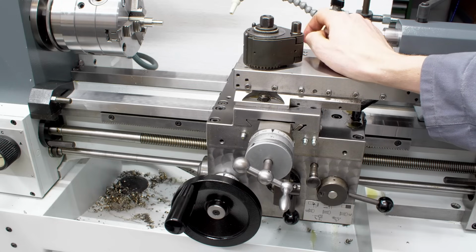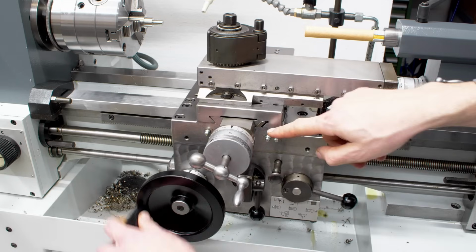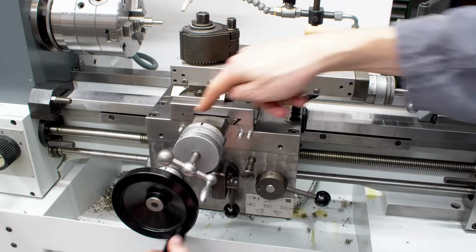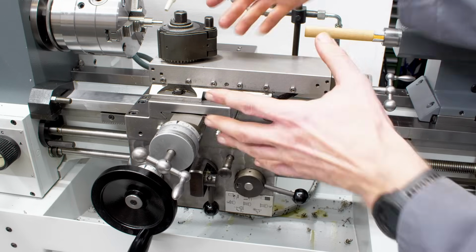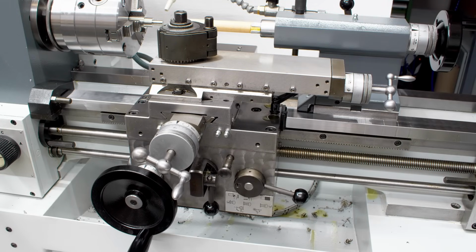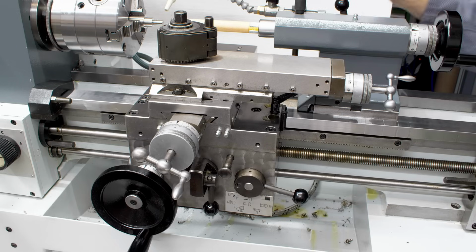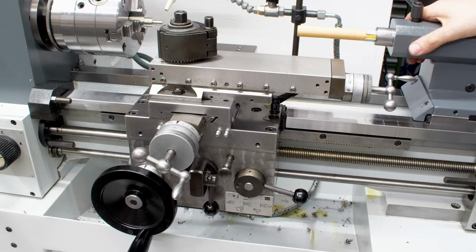This machine is built for 12mm tooling. So that's the carriage, and you see all the fittings here, the Zerk fittings. These are for lubricating all the moving elements. We have the tailstock, Morse taper 2, with a nice quick action clamp. And well, it's a tailstock. It's a good place to hang the air hose or to do extremely heavy drilling compared to the compound slide.